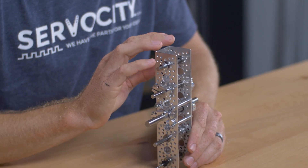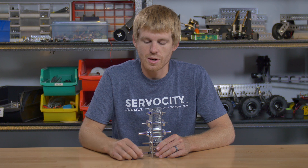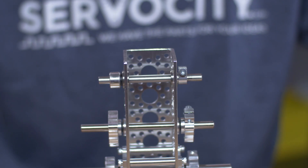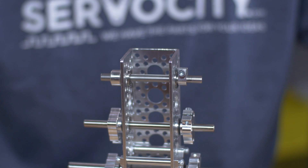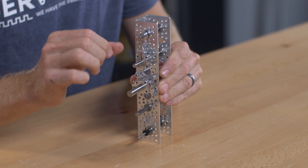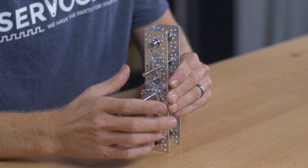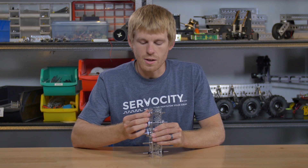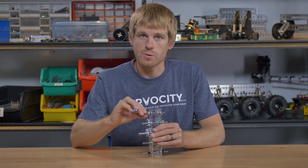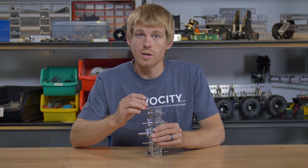Starting at the top, this is probably the most common way to do it. Quarter inch shafting is by far the most common shafting to use with Actobotics, and that's due to the fact that we have a quarter inch ID, half inch OD flanged bearing. So you could just take two bearings, one on each side, slide them into the half inch holes of the channel, and then slide a shaft through. In order to hold that shaft from moving back and forth, I grabbed a quarter inch shaft spacer, put it up against the inner race of the bearing, and then slid a set screw collar onto this D-shaft. I like using the set screws with D-shaft because you can run that set screw down on the flat, and it doesn't mar any of the critical surfaces — so if I were to disassemble this and needed to slide a bearing off, it's not going to mar any surface that the bearing contacts.